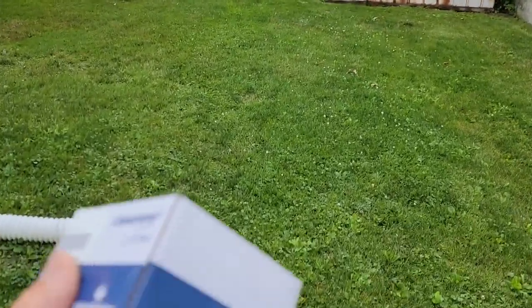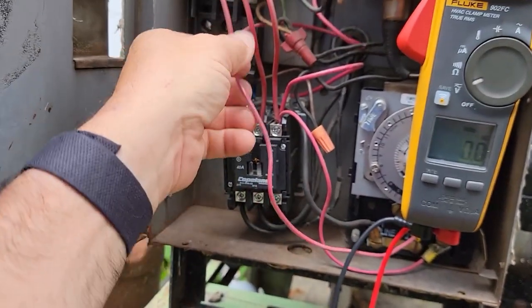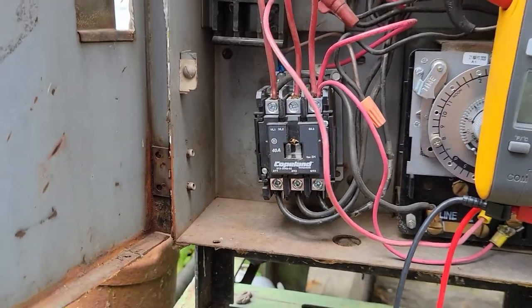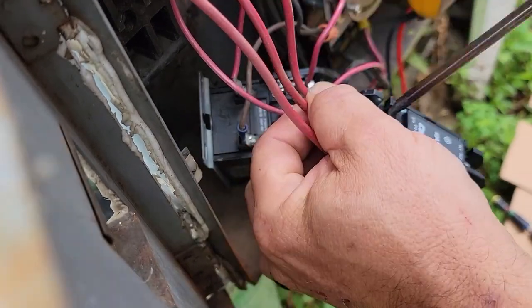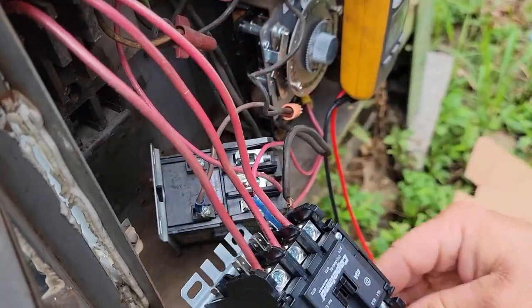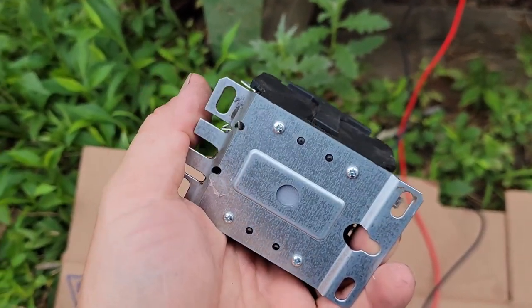It appears we've got a storm brewing. So we've got a contactor here — let's get this puppy in there. I don't hear the clock running. Power does not appear to be going to ground; hopefully it's actually grounded. If we work fast before somebody bumps the plug, we should be able to get this done before you get shocked. Give this a sniff and you can smell it — you can smell the coil's burnt. If you yank the bottom off of that, you'd probably see that it's burnt.